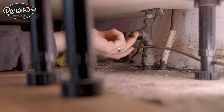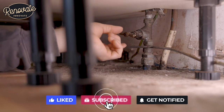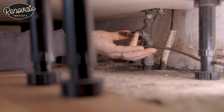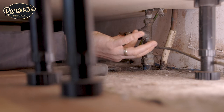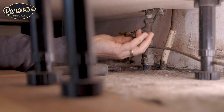Here's our leaky tap. It's been leaking for a little while. The first thing you can do to attempt to stop it is just to tighten this nut here. Just grab some pliers, water pump pliers, whatever you've got, or a spanner that fits on there. Just give it a little quarter turn. You might need to hold on to the main body of the tap as you do that.